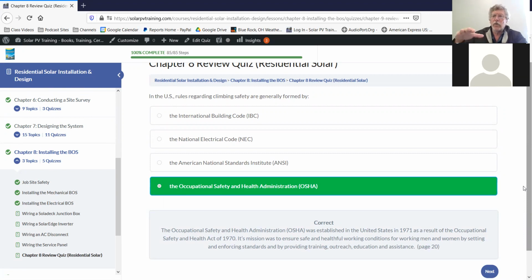Because they're usually 4 to 6 inches or so off the deck, it's almost like putting an aircraft wing on top of a roof. You get lift and you also get pushing down. So it can put as much as 50 pounds per square foot of excess pressure on that roof deck, either in lift or pressing down. Wow. Yeah, it's substantial. So the weight of the system is not the big deal.